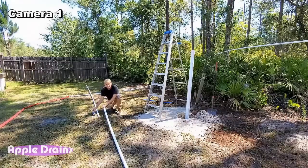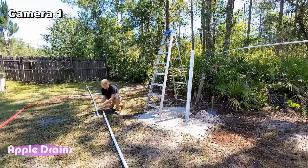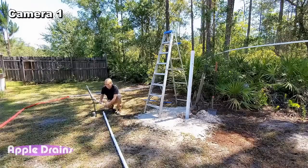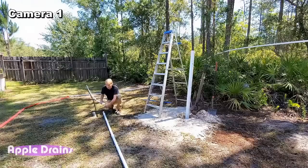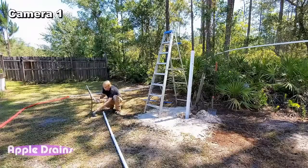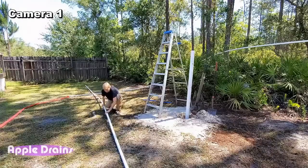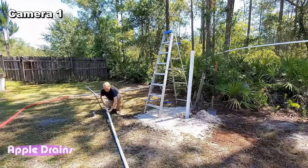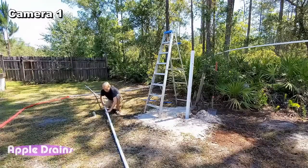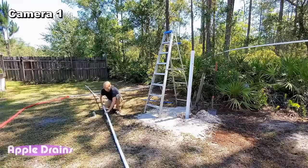I've already built this well point. We've got about 8 feet of inlet. Remember, the water is going to be all around the outside of that pipe, and so we can easily collect that with the suction from the pump. And I've just got an old pump I'm going to use, but we're ready to sink this down nearly 30 feet when we're ready, and I think that's going to be more than enough.